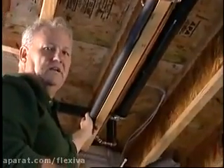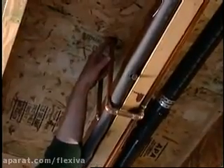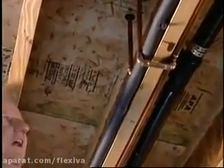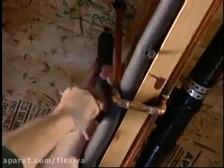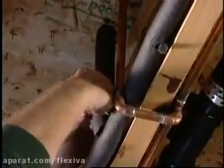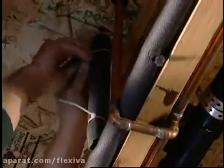What we have here between the floor joists is a sink. The three-quarter inch hot water line will continue down to a shower. The cold water line is on the back side of this joist, looping around and coming up. As you face the sink, the hot water will be on your left side. We've gone from a three-quarter inch line down to a half-inch line, so we want to put the right size jacket on — using the half-inch pipe insulation. I've also cut it on a 45-degree angle so it'll infill as it lays up against the three-quarter inch pipe. A couple zip ties or electrician's tape and we're good.